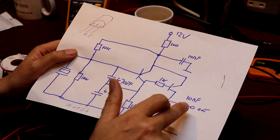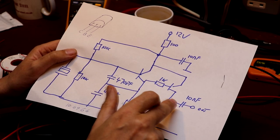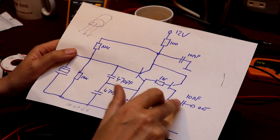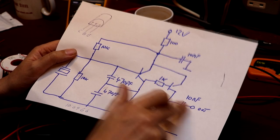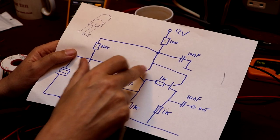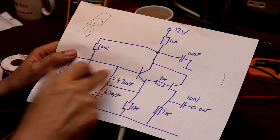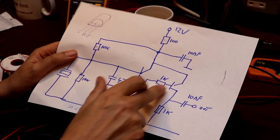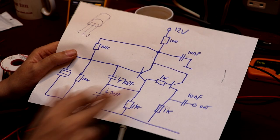The reason we've included this buffer is because I'm actually going to use a telescopic whip antenna, which will alter the amplitude of the output waveform. I'm going to be able to control the coupling into the circuit this is feeding. I don't want changing the telescopic length of the antenna to load up this main oscillator transistor — because if I connected the antenna directly, the changing capacitance could actually pull the frequency slightly. Using a buffer amplifier installed here will just prevent that from happening.